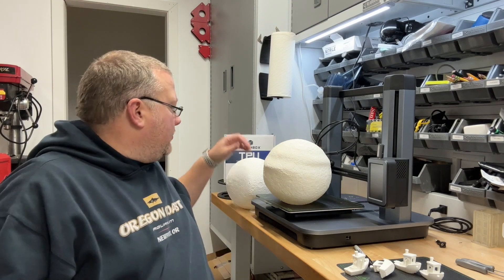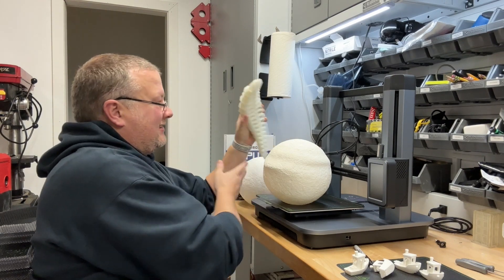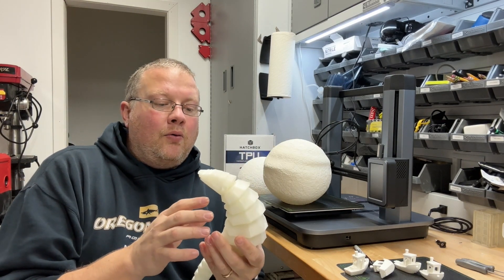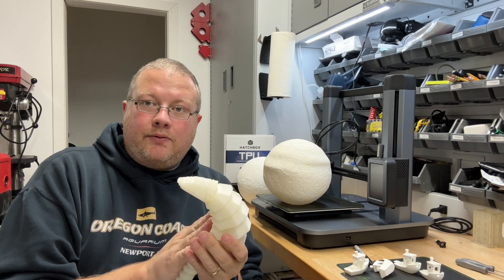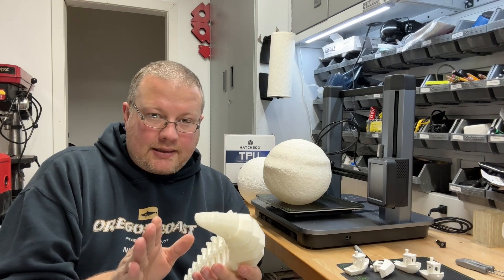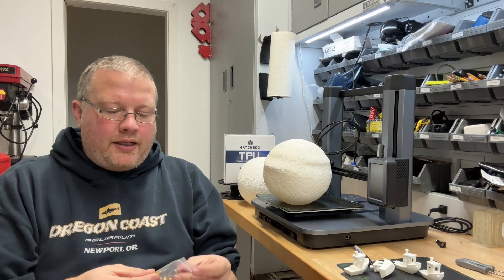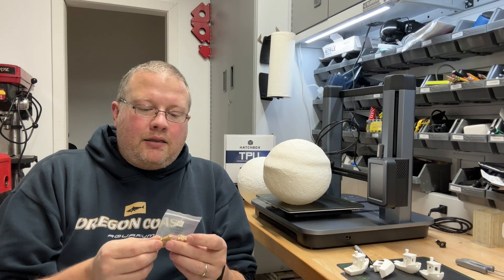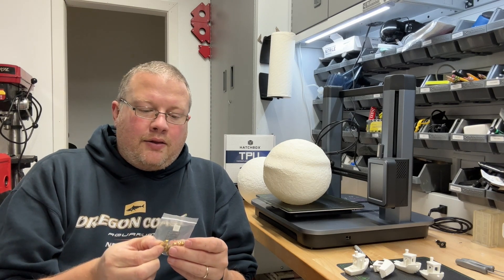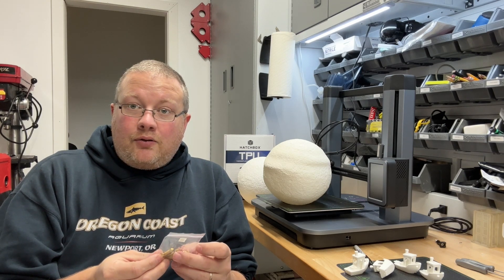I also got a comment from Birdie. The glow-in-the-dark material that I used to create this is abrasive and it will wear down a brass nozzle prematurely. I've got some basic specifications of the nozzle that I'm going to confirm before giving out, but they provide a total of ten nozzles that are 0.4 millimeter with the printer, so I'm not real worried about having it wear out quickly.